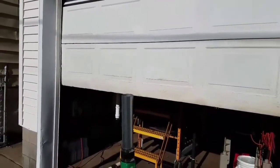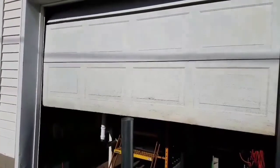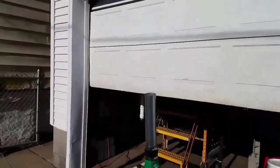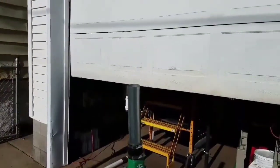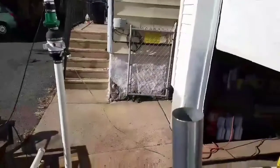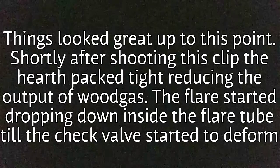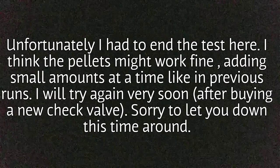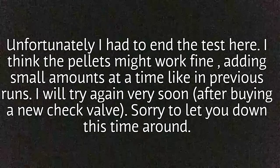Just fired up the filtered flare. The blower's running at 30 hertz. You can see the heat signature marks on the door - it's lit. See more smoke coming from the exhaust, but still running on propane yet. Didn't do the switch yet. I don't think we're going to really see the flare.